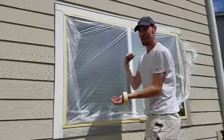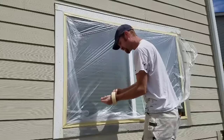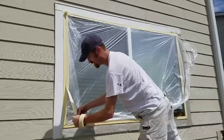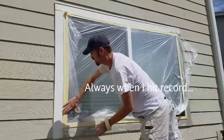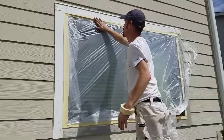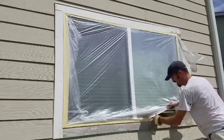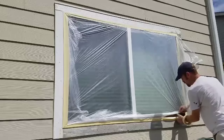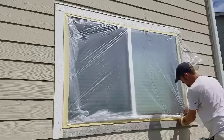Before I move my ladder just about a foot over, I put the tape up there going corner to corner. I don't need to do the top because I know I did the top pretty tight. I'll fix the bottom — pull it out, tuck it up, and use your fingers behind there to pull that excess out.